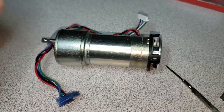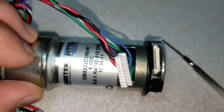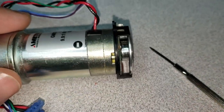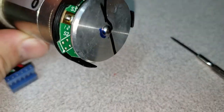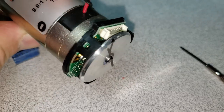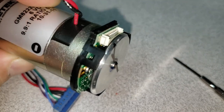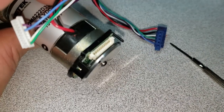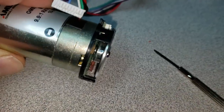Testing with my meter, the motor shows open-circuited, which is kind of what I expected. That implies probably just the brushes have failed. I'm going to see if it's possible to get into the back end and try to service the brushes. If a coil's burnt out I'm out of luck, but if the brushes are gone I don't know if I'll be able to make a viable replacement, but it's something I can at least try.